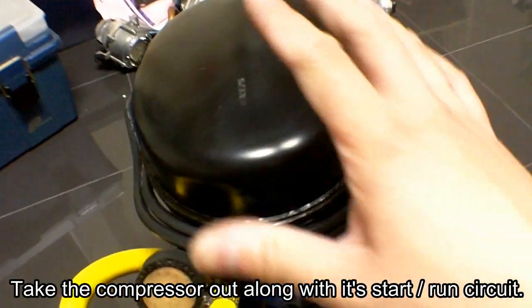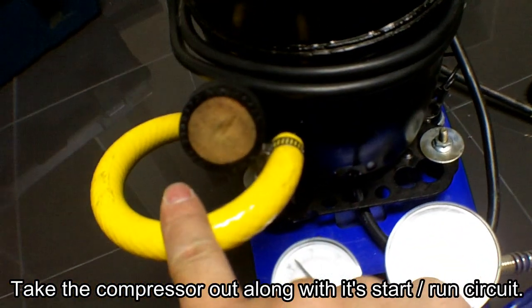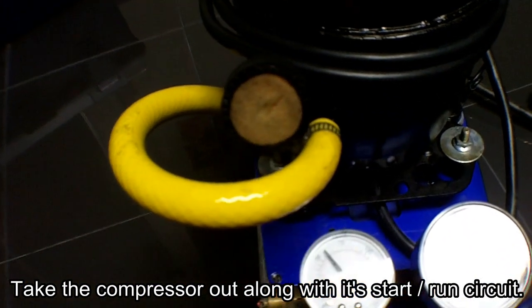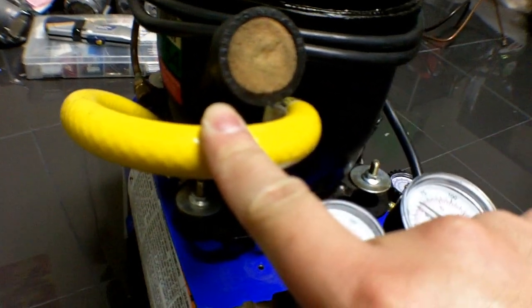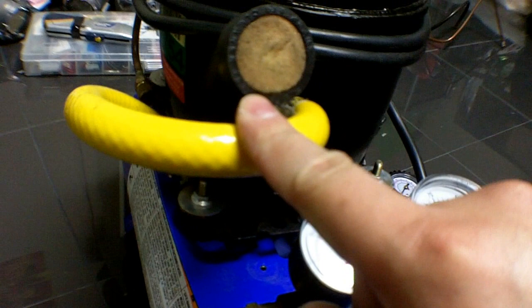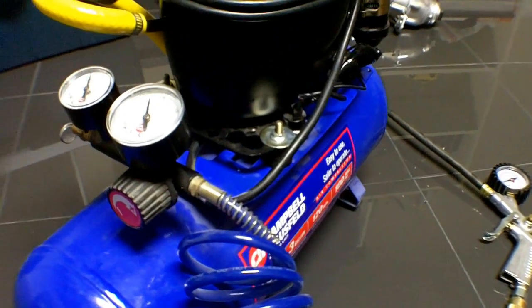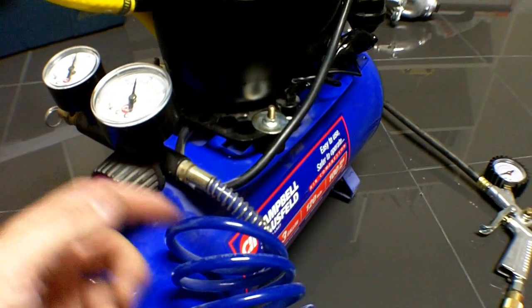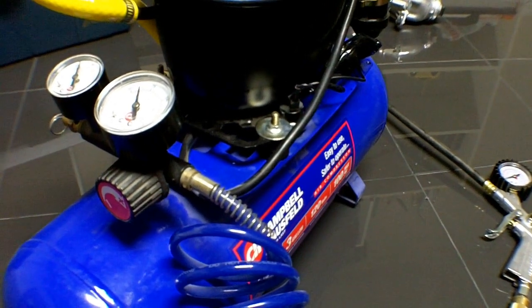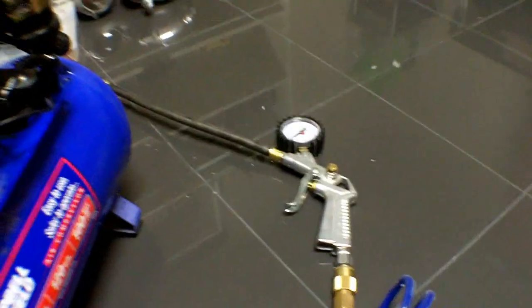Obviously you would need a compressor from a refrigerator, and an air hose which I got from the hardware store — this one cost me $3. Make sure your air hose can withstand the pressure of 100 psi and up; mine is rated for 300, so that's more than enough. What I don't have on my compressor but would highly recommend is a water trap or moisture filter. It usually goes in line from the tank to the hose and catches any oil or moisture residue from blasting out the other end.